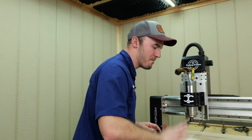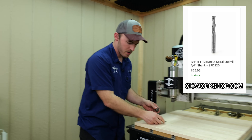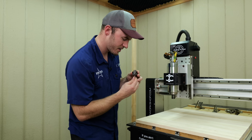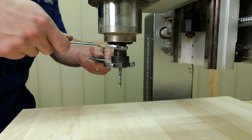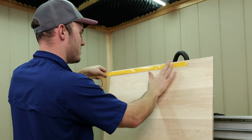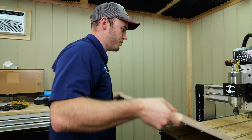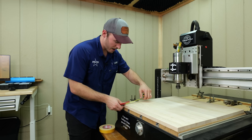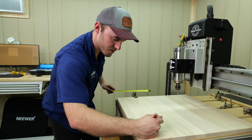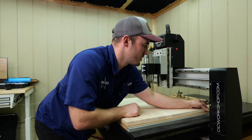The first thing we're going to cut out is the base, so I have my maple panel that I make in the shop and sell on CIC Workshop. We're going to put our quarter inch down cut bit in — you chuck it up, make sure you don't go past the back. Since it is the center origin we do have to mark the center point. To hold this down, since I do not have a vacuum table, we're going to use double-sided tape. Now that the tape is on, we put it back in its spot, mark out roughly where it's going to cut, and make sure clamps are nowhere near what I call the danger zone — and the uh-oh zone.